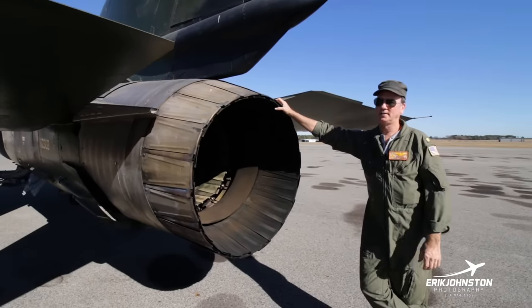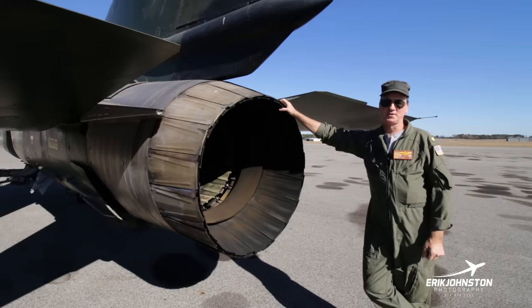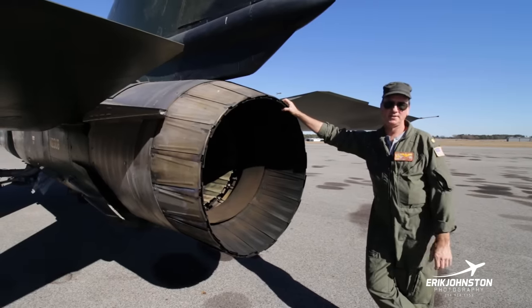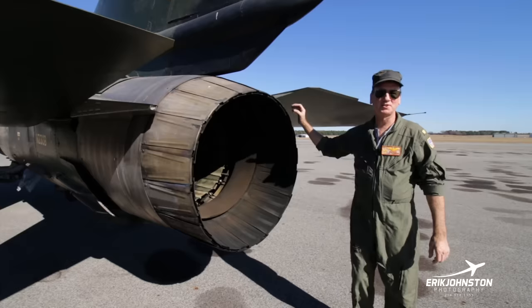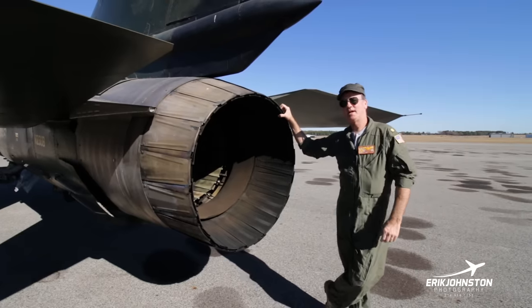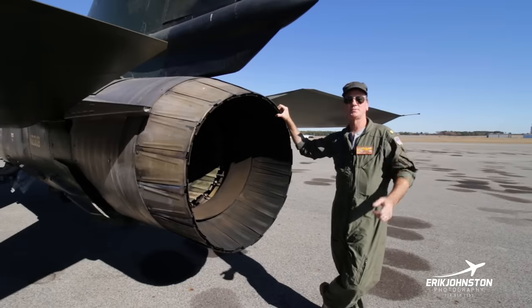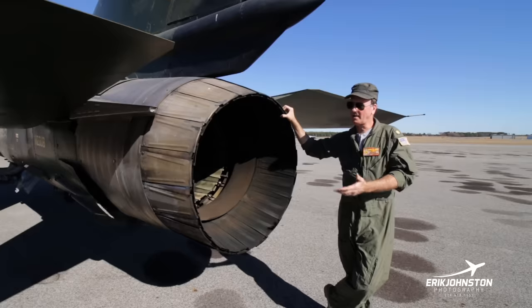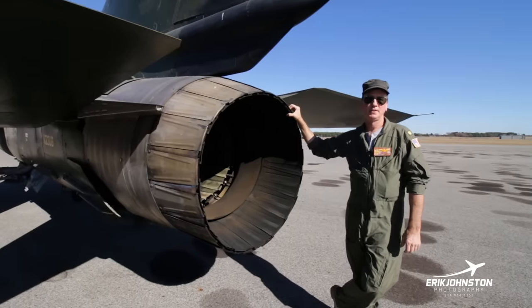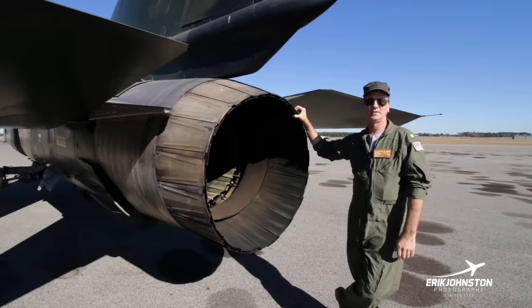And the problem with if you're going to try to air taxi it, you're up on the power. The brakes on this airplane get hot real easy, really fast. I would say that seems to be the biggest issue that I've had with the airplane. It has these fuse plugs at a certain temperature. They're designed to release the pressure so you don't actually blow the tire. But the brakes get very hot on the two-seaters. They have brake fans on them, and they do an okay job, but they don't always cool the brakes